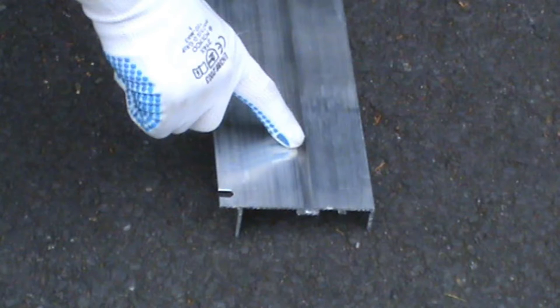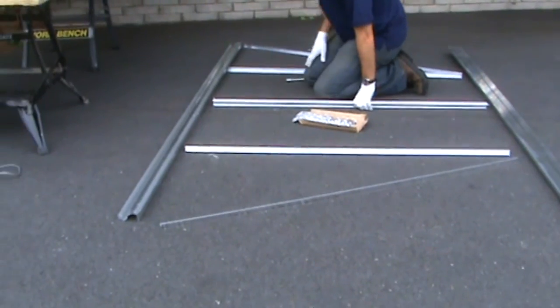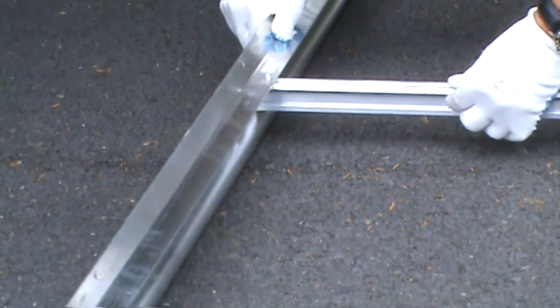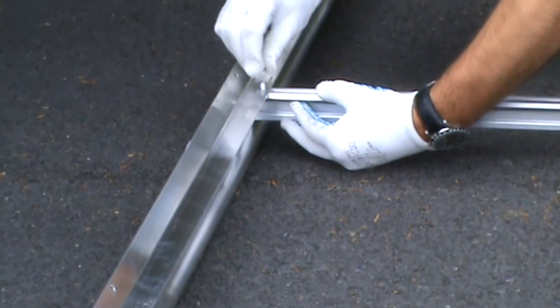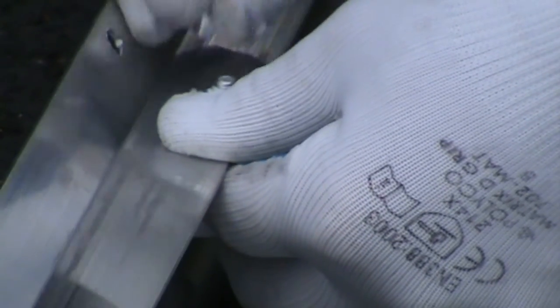The side glazing bars and built-in base section: the bolt channels should be facing skywards. Slide a bolt into each end of the glazing bar, then fix the glazing bar to the gutter by pushing the bolt through the hole in the gutter bar and securing with a nut. It is important that when you tighten the nut, the glazing bar is hard up against the gutter. Tighten first just with your fingertips and no tooling.